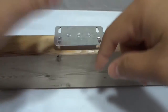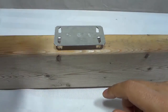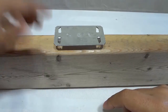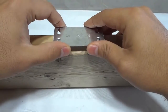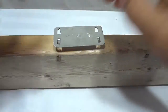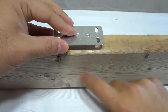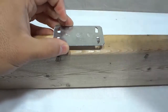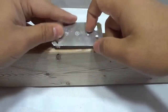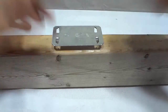Because if you cut the electrical wires and they're behind the drywall, it can cause a whole bunch of extra work. So if you use something as simple as these electrical protection plates, and you hammer them into place over the wood where there is electrical wiring, they will save you. They could potentially save you a lot of time in the future when you are screwing the drywall into place and when you are putting any screws into the wood for any reason.